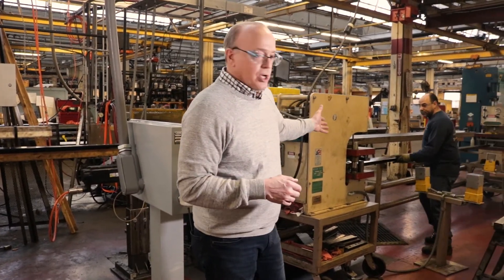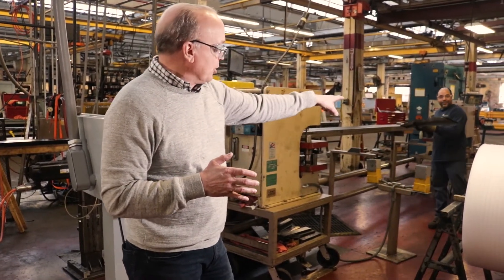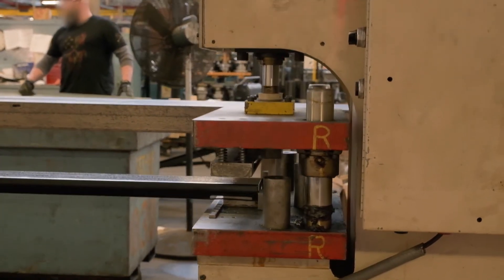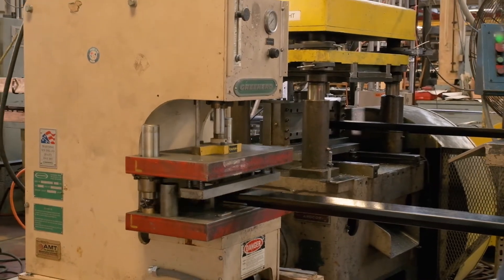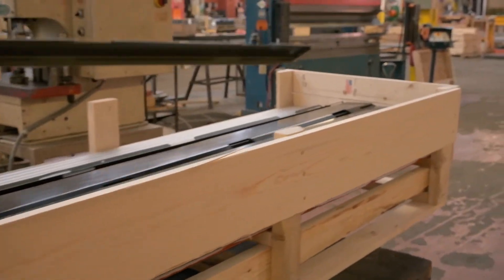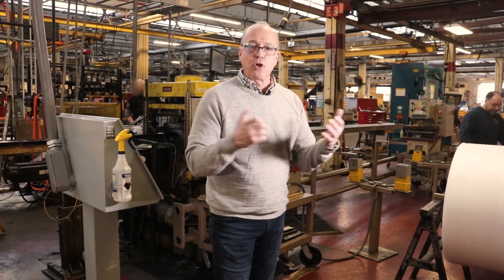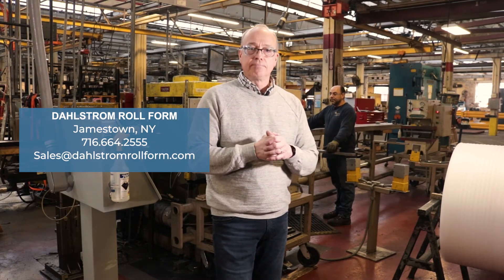Jim here is doing some additional end bends on these parts. With pre-painted steel, we're doing some end flanges at the end because roll forming can only do linear bending — it cannot do end bending — so we have processes we roll into place and then perform these kinds of operations. This concludes the process. The parts go into a packing crate that will be buttoned up and shipped to the customer, all barcoded and ready to be received. That's all we have for the series — the anatomy of a roll forming line. Thanks for listening, and if you have any questions feel free to contact me at Dahlstrom Roll Form or any of our account management staff. Thank you, we'll see you next time.